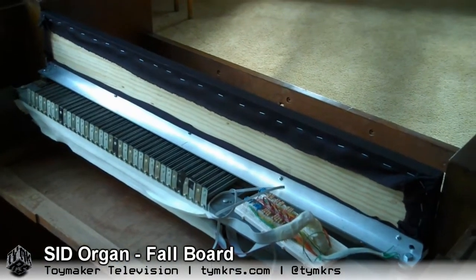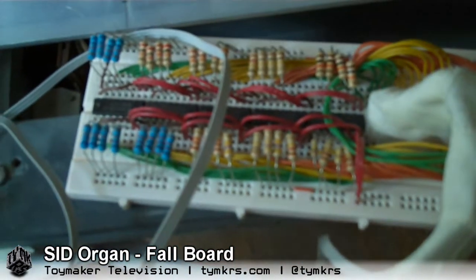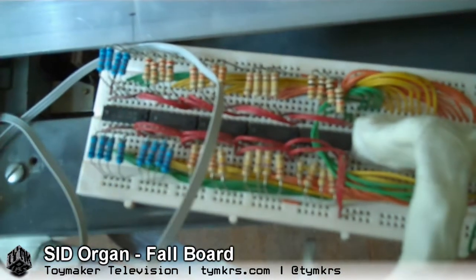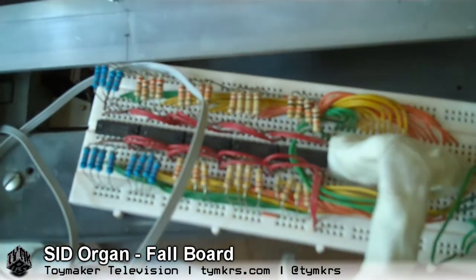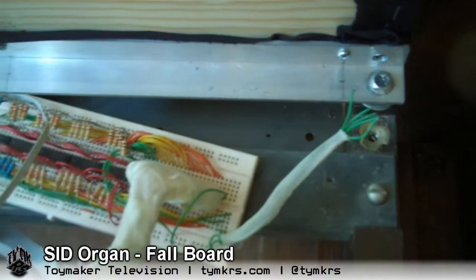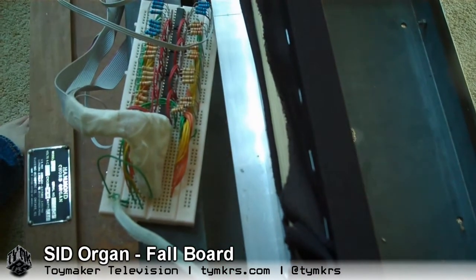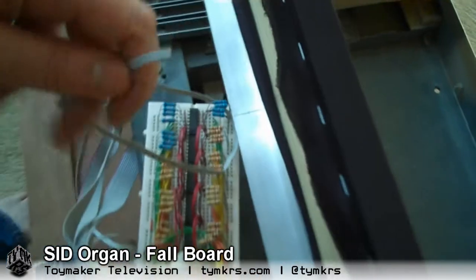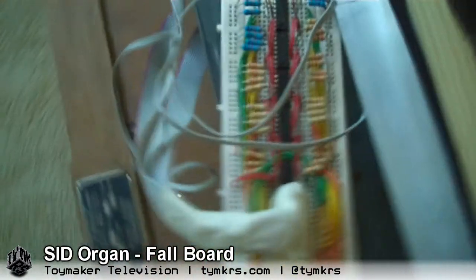We had a couple of questions on the last video. This here is a bunch of shift registers — if you haven't gone back to the earlier videos, these are a daisy chain of five shift registers with pull-down resistors, and every single key on this keyboard goes to one of the eight pins on each of these. Down this cable you connect to your microcontroller and serially figure out the state of every single switch — that's five times eight binary bits. There are 37 keys on here so we have a few left over, and those will go to a switch on the interface. There are also two foot pedals down below — you can see the back of the foot pedals here.